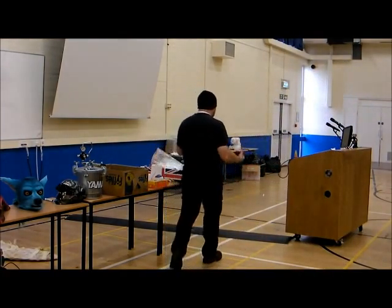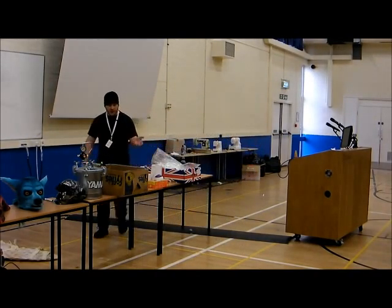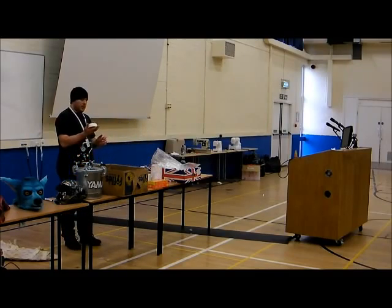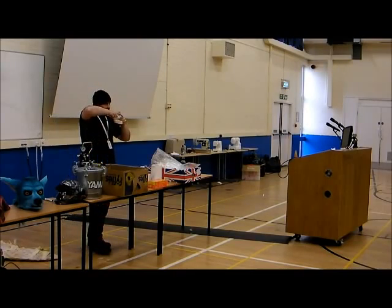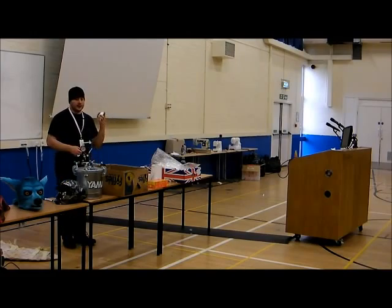Right, so you've got two moulds. You mould your first one, you paint it up, you then pop that into the second mould. What I do is I leave little tabs so it'll sit in, so it won't go any deeper than it's meant to. Then you've got the little holes and you'll have a little gap around the edge. And you get clear resin, clear polyester resin.